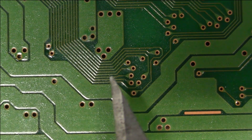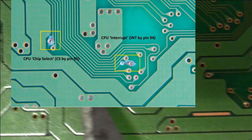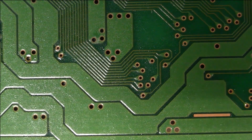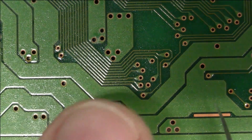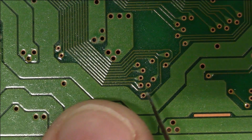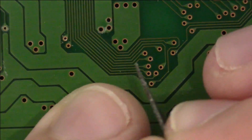Now, just as the picture I have superimposed here suggests, we'll be working with the CPU chip select signal, which is right here, and the CPU interrupt pin, which is buried right in here. The only trace that we need to cut is the CPU interrupt pin. So let me get out the X-Acto knife and get my bearings here.